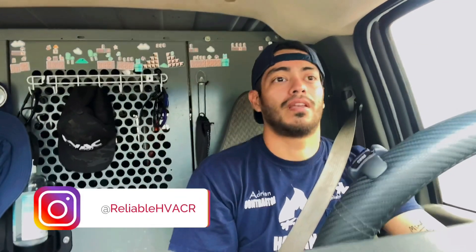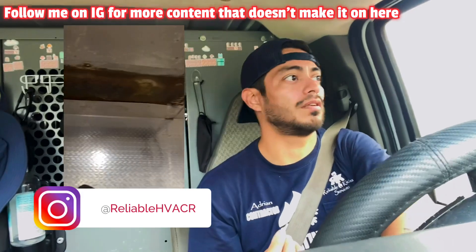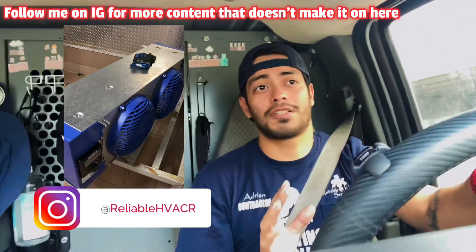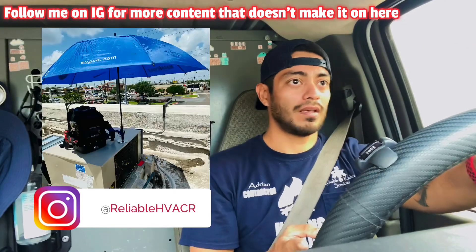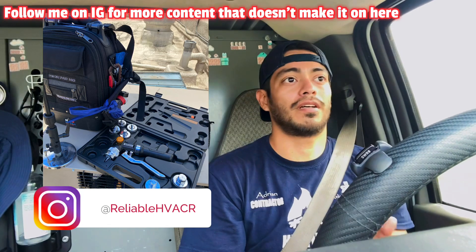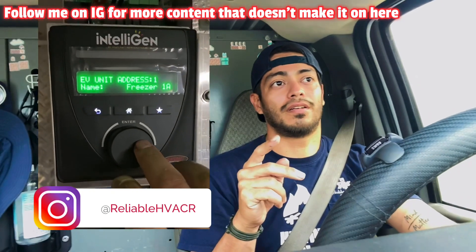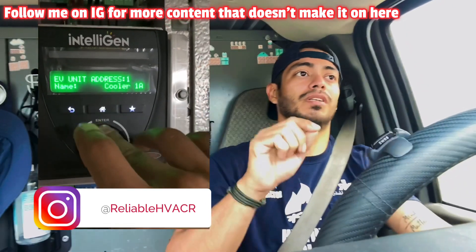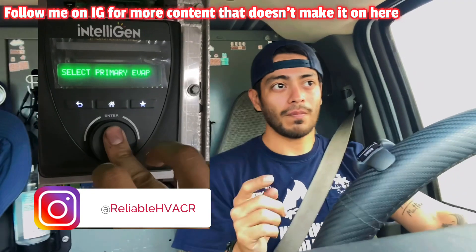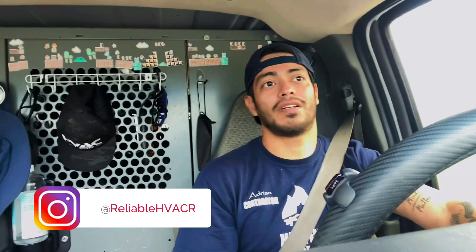Alright guys, it's the weekend again — a lot of my calls are on the weekend. We gotta go back to that walk-in that we just put in an Intelligen top and bottom unit. I actually love those things because you just hook up your condenser, hook up your 3-phase to your contactor, however you hook it up with 3-phase voltage, and then on the evaporator all you do is feed your 115 to a terminal board, and it'll feed a transformer and feed your board. It takes care of everything else — you can do the defrost from that controller and everything.